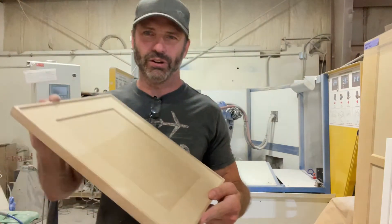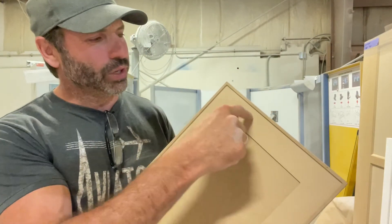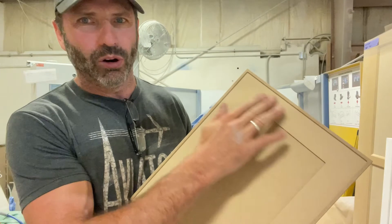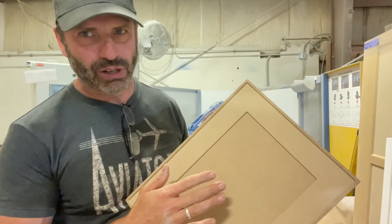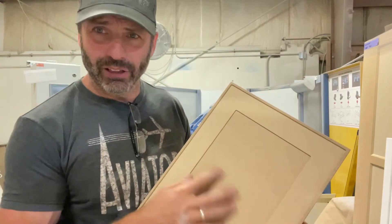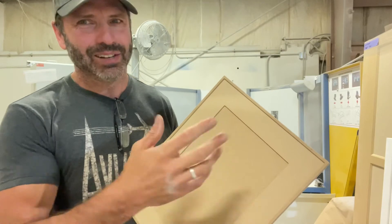Maybe even a door like this — you could, if you turned off the rail style portion, it would read the outer frame and down to the panel and sand the panel no problem. But it's not equipped with a sander that's going to do a good job on this part of the door, and this part is so thin that if you come down on that with a palm sander you're probably just going to sand through. So again, it's too fragile, it's not worth it. I would just do this door by hand. If I had a big order with lots of big doors where the panel needed sanding — the back sands fine — I'd probably just do this part by hand and send out the panels on the robot. But to sand through all three levels, it's not going to do it.